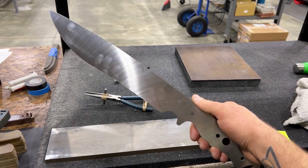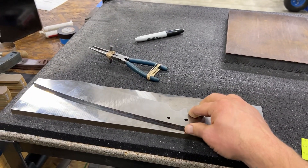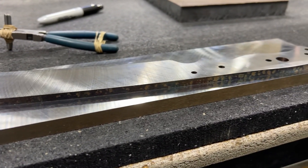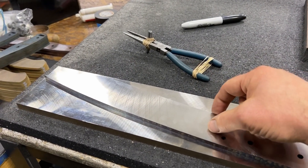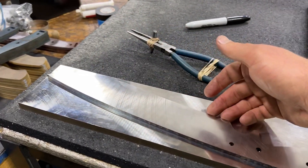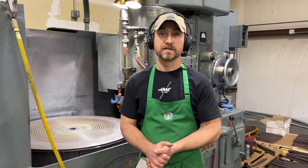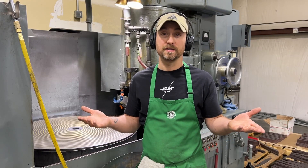We're all ground on both sides here. Other than a few fingerprints this is a clean part, so we're going to go ahead and do a flatness check — and unsurprisingly we have a nice flat part. That's going to result in better sheath fitment because the tip won't want to go to one side or the other, and we'll have much more uniform grinding from side to side and a really uniform edge thickness the whole length of the blade. So there you have it — that's how we grind a GSO 12. I hope you found this video informative. Have a great day.